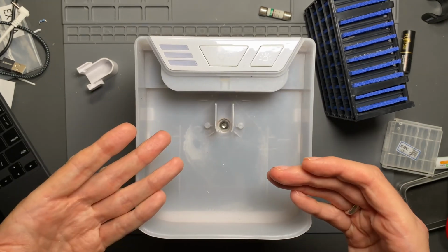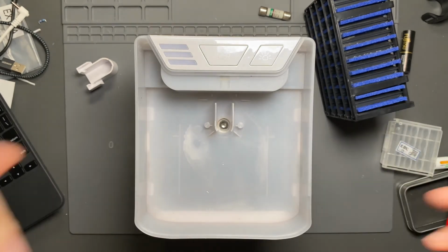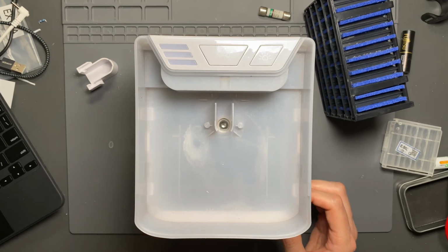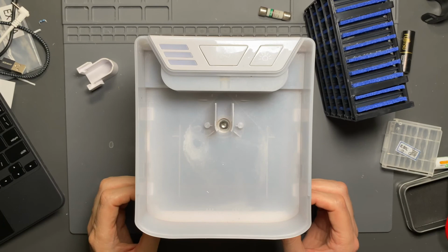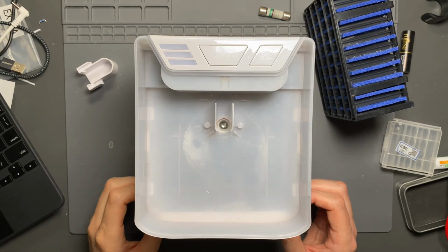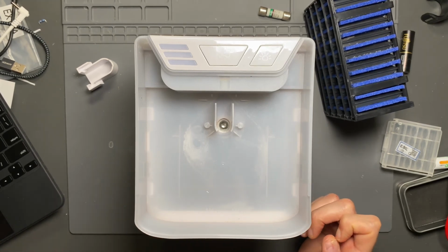But for these sorts of things where you might turn it off or it's on battery power or whatever, non-continuous use increases the chance that that might happen. So I would stay away from the capillary action ones and look toward the ultrasonic transducers or some other kind of pumping mechanism that's active as compared to capillary action. Hard water also can clog those filters eventually, making them less effective if they're only using capillary action.